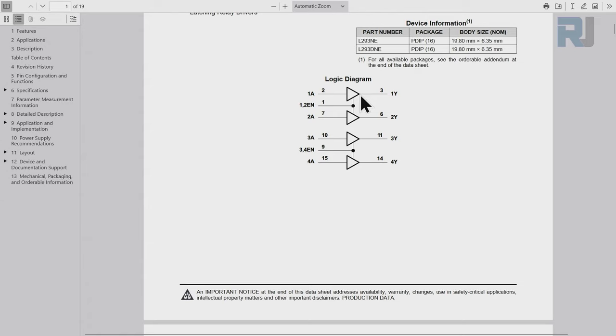The value waits two seconds at maximum, then goes back down. Now I'm turning it on and connecting the 5V. With lower values the motor goes very slow, and as it reaches 255 it's at maximum speed. Then it slows down. At around 60 it starts rotating - that threshold depends on the characteristics of the motor.